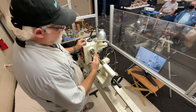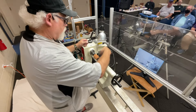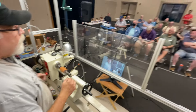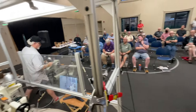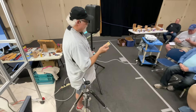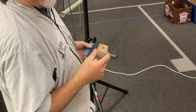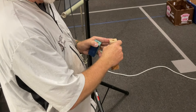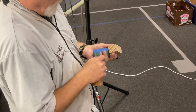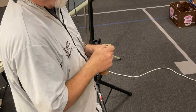I'm not too worried about it splitting the piece or leaving a big dimple, because I'm going to turn the top of the mushroom on that end. Someone asked: how do I prep the piece before turning? A lot of these blanks are cut to a standard size — about one and a half by one and a half by two. I drill it on a drill press with a jig so it's flush straight up and down and won't rotate. I mark the center on both sides, then use the recommended drill bit.